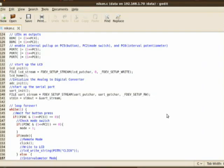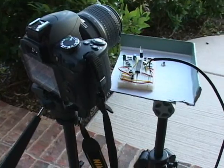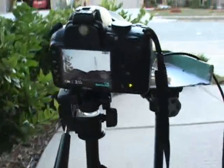The software for the intervalometer isn't super complex. Basically, you turn it on and it waits for a trigger. Once you press the trigger button, it looks to see what mode it's in. If it's in remote mode, it takes a picture and waits for the button again. If it's in intervalometer mode, it checks the interval setting, takes a picture, waits until the interval has passed, takes another picture, and keeps cycling like that until the battery dies.